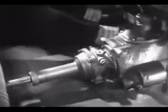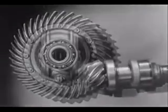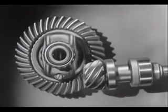Of course, we could lower the floor and ceiling, but the drive shaft would be higher than the floor. This would have disadvantages. A shaft in the middle of the floor of an automobile would be inconvenient for passengers and would be awkward for carrying luggage. Today, engineers have found a way to make the car roomier and closer to the road without a clumsy shaft above the floor. The drive shaft from the engine to the differential is lowered out of the way, and the drive shaft is connected to the rear axle at the bottom.